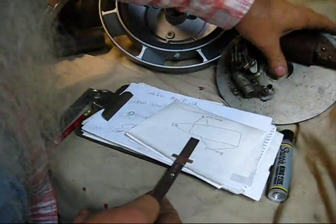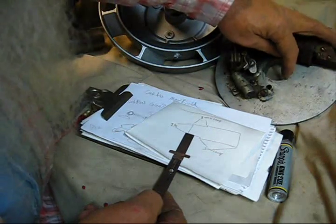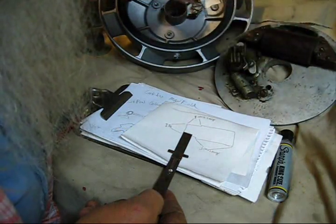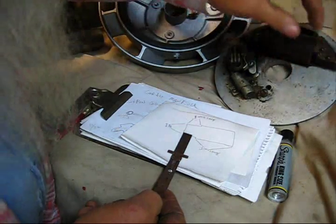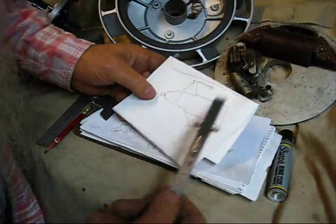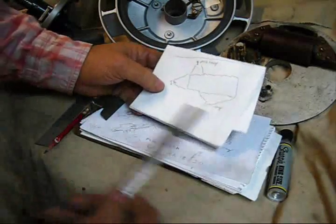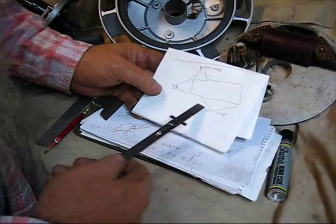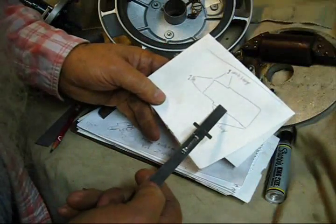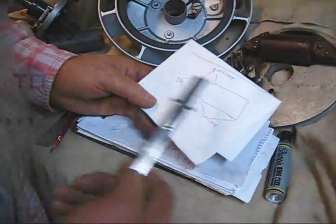We want a sharp corner right here, because there's a couple ways to go about this. I could put a pin in it down there so it bottoms out — I'm going to put a sharp shoulder. When you insert that into this bore here, it will just bottom out right there. Then I'll turn down the outside of the material up there just where it cleans up, whatever size it is. I will measure this right here with the ruler — one inch there, give or take. Within an eighth of an inch, you'd be okay. We're going to get on with building this little thing.